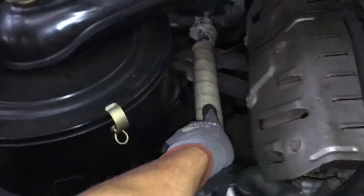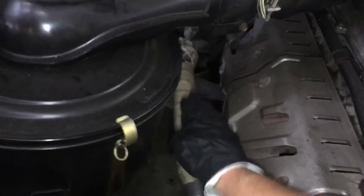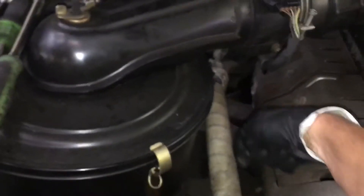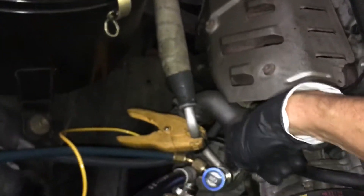In this piece of rubber on this hose right here, delamination has occurred. It's flapping down like a valve and coming down like this, impeding the flow of refrigerant in this direction to pull it through this service valve on the compressor.